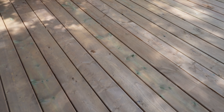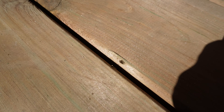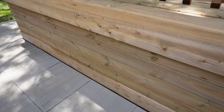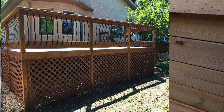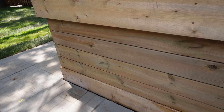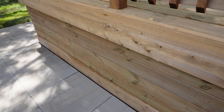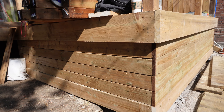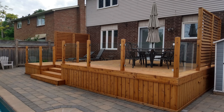I'm definitely going to keep using the CAMO system in the future because I like the way it works and the final product looks nice and clean, but it depends on your budget. Moving on to the border and the sides of the deck — we ended up doing a border with two-by-ten to give it a nice framed-out look. I've seen a lot of decks where they'll skirt the sides with a simple lattice, but our client has a young daughter and a dog and his basement tenants also have a dog, and we often end up repairing lattice when it's at the skirt of the deck. So we ended up doing horizontal deck boards — a two-by-eight along the bottom and then deck boards on top, hidden behind the two-by-ten wrap-around frame along the top. It looks really sharp, almost like it gives the deck a lot of weight. I don't think lattice looks that good, and I've also done this with vertical slats, but the client opted for the horizontal look.